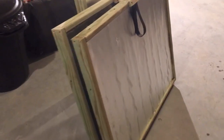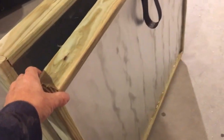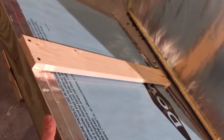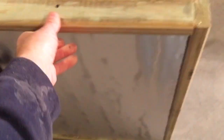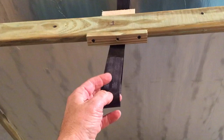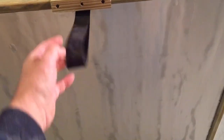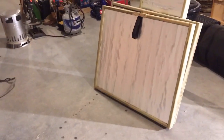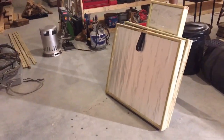The panels are basically frames of pressure-treated five-quarter decking with the foam inserted into the frame. There's some scrap wood on the back just to keep it from bowing out, and I used some leftover strapping from when the roof of our modular home was raised on September 3rd. I'm going to slide these into position to show you how this all works.